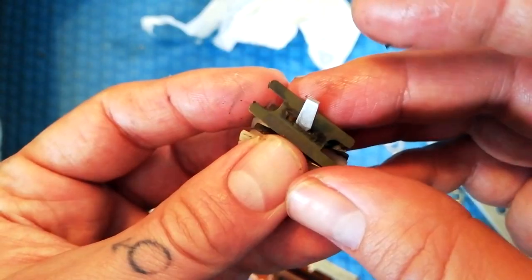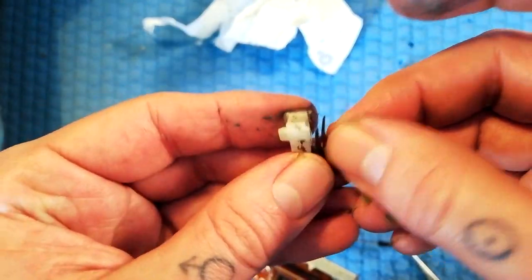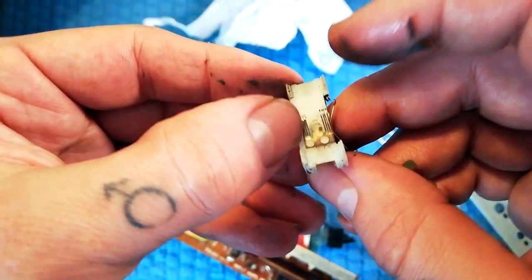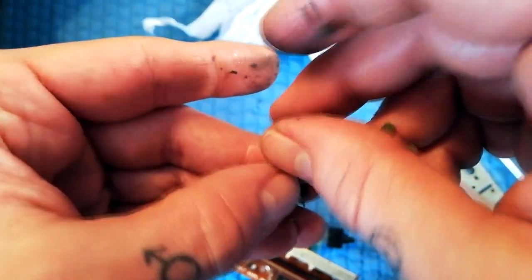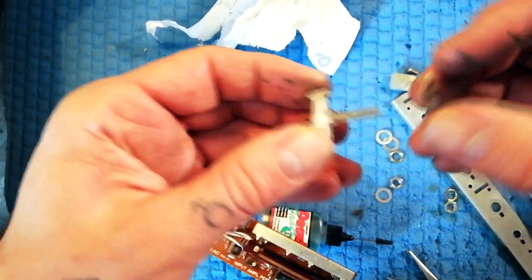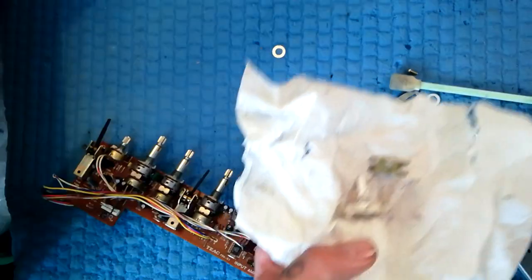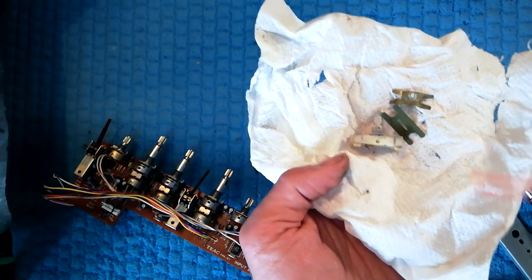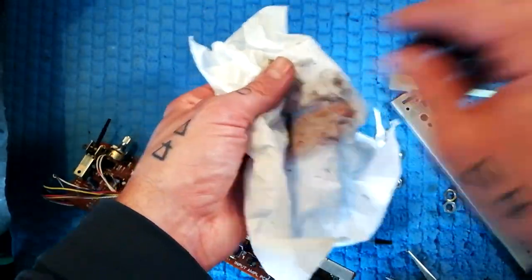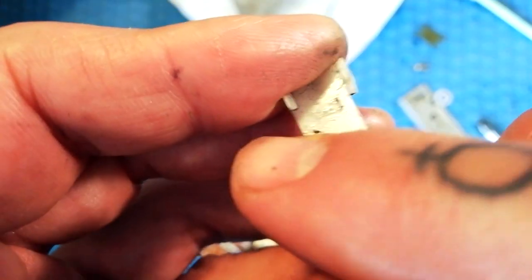This part will come out altogether. You can end up with a lot of dirt just at the top there, so depending how dirty your fader is, it can be worth completely removing this and getting some of the grime off. This little brass part — or it might be copper, some other metal — that'll come off too. Just put the parts in a bit of tissue, put some contact cleaner on them, and give them a wipe. If any of these bits are bent, bend them back into place.